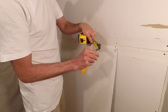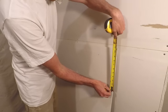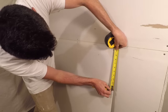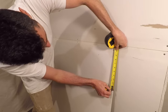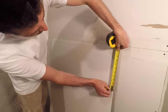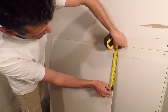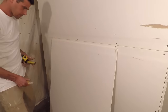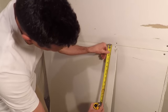Okay, so how do we do this? Get your knife in position, find that little puncture you just made, then what you do is you pinch your blade — I've got my finger resting right here — and I'm getting ready to pull. I make sure that I don't warble, that I stay totally parallel, keeping it taut, and I just go along here like so.